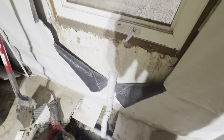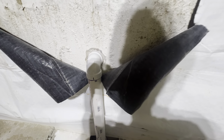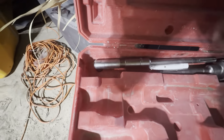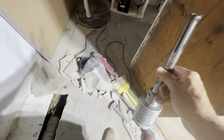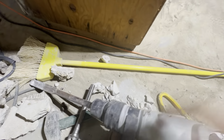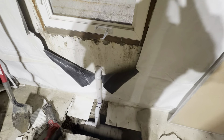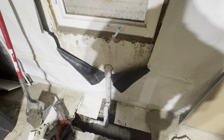The way you do this is you need to drill a hole in the foundation. I got a hole saw that drills a two-and-five-eighths-inch hole, which is big enough to accommodate the outer diameter of a 2-inch PVC pipe. I have this hand jackhammer and this is the hole saw that goes onto it. You set it for hammer drill mode and just drill away. I have about a foot of concrete here so I had to put an extension on it, but when I was done I had a two-and-five-eighths-inch hole going straight through to the outside.